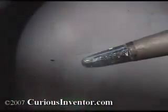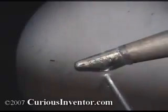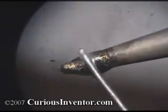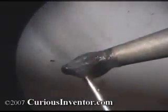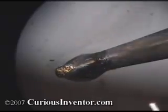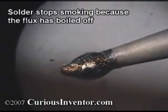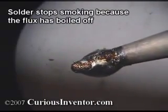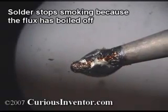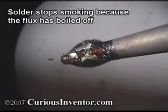When you apply fresh solder to an iron, the fumes are actually from the flux boiling, not the lead. Lead boils at over 3,000 degrees Fahrenheit, and typical soldering temperatures are only between 600 and 750 degrees. However, if you do get the solder past 850 degrees, the lead will more readily atomize into small particles that will indeed float in the fumes. You're unlikely to get lead poisoning from soldering at typical temperatures, but the fumes are still not harmless — long-term exposure to solder fumes has been cited as one of the leading causes of occupational asthma.